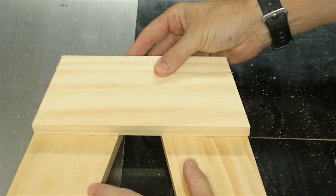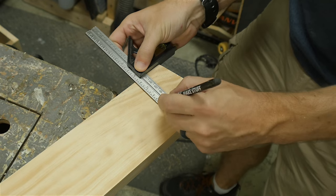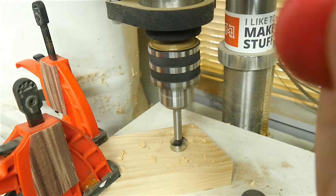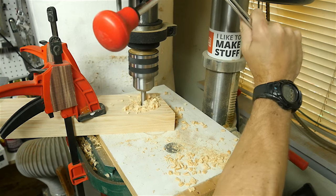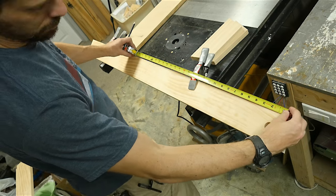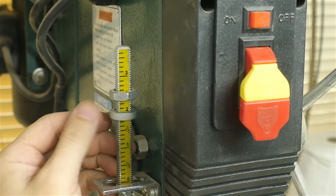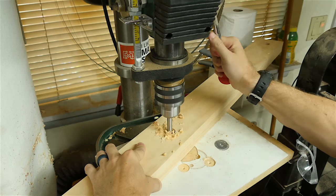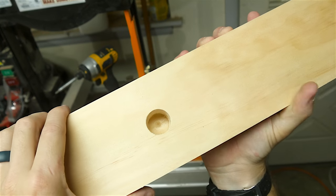To mount the paper roll, I needed a hole in both legs drilled in the exact same position, so I clamped two legs together and marked the same distance from the outside and the top. I used a Forstner bit, the same size as the dowel that I had, and drilled a hole through both pieces of wood at the same time. I measured down and made a mark where I wanted the bottom roll to be and drilled another hole, but this time I set the depth of the drill press so it wouldn't go all the way through. It leaves just a little bit of wood so that the dowel won't run all the way through — it has a way to stop.